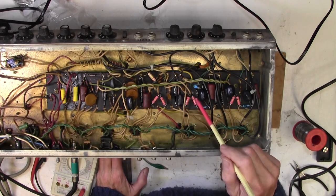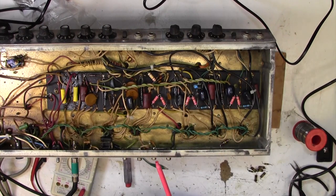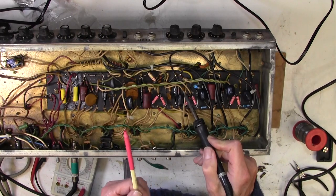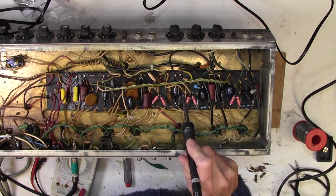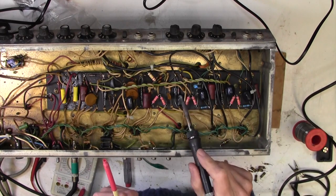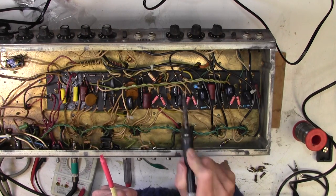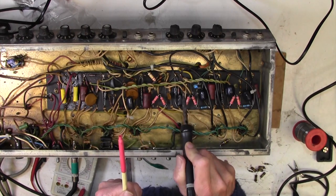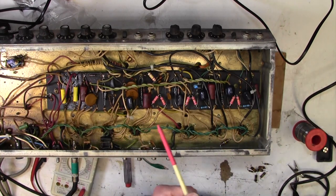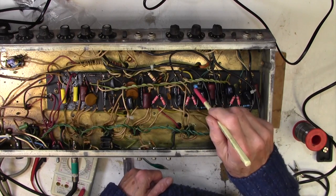Now that to me is almost always a dodgy component. Well, we've changed these two. And I've used a little trick by putting the soldering iron close to a component. For example, this little capacitor here is a good candidate. You can heat it up individually, and if a little squirt of the heat gun makes it go, then certainly bringing this soldering iron up to it would cause it to fix the problem too. And I haven't been able to narrow it down to either this resistor here, this capacitor, or this capacitor.